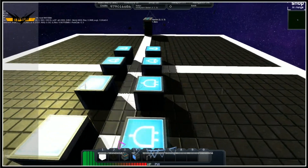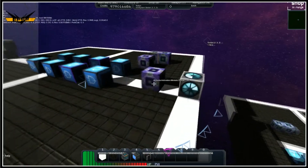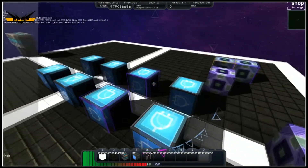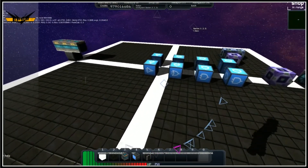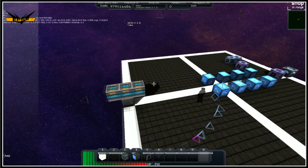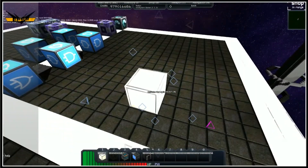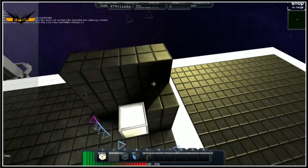I need to connect the clock up to the second AND — correct, to both of them. It may just not work. You activate it and hit the input, and every time you hit the input it should flip. But it might also just start flipping constantly with every single clock pulse. Hook up a light to the output as well, because a light would activate faster so you can see it.